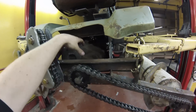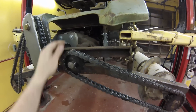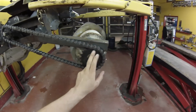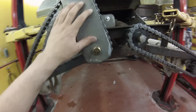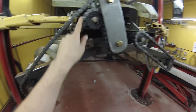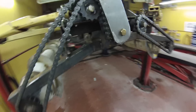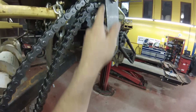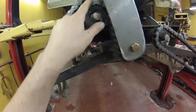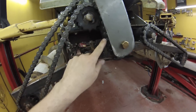Here's a better shot of the transmission differential setup turned sideways, now that I've got it up in the air. One side of the original axle is driving this track this way, and then this contraption here is allowing me to drive the back side of the chain, giving me my change in direction. The screws are turning opposite, so I have two idlers — the reason for two rather than just one is that I wanted a good wrap around this gear with quite a few teeth touching.